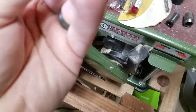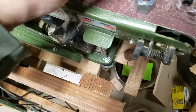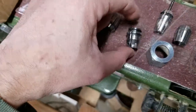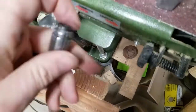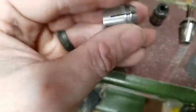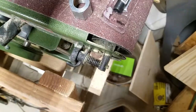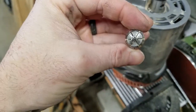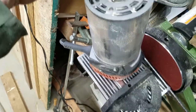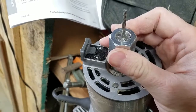Then I bought a replacement collet sized down to 12 millimeter — I've got an adapter down to a quarter inch in there right now. That one is tapered, it's not an ER 16 taper, but tapered very similarly to the one that came with it. This one and this one were sold as replacement collets from China for a Ryobi and a Rigid router. I've been using this ER 16 for many hours of cutting. It holds an eighth inch right in there, and with the spring clip removed it tightens right down — doesn't wiggle.